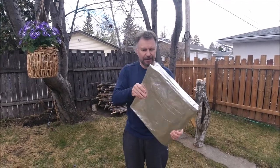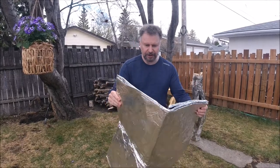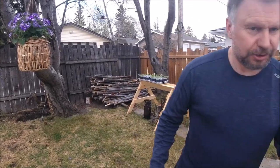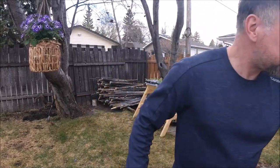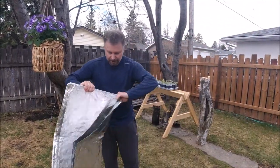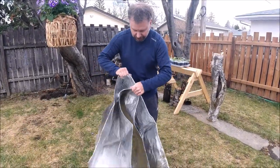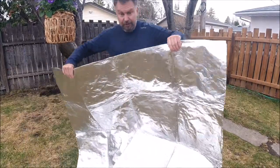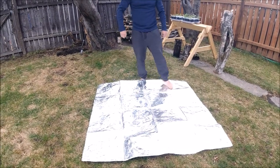So this is our solution. It's the same welding mat — fiberglass — but what we've done is we've taken aluminum tape, which looks like this. This is used for furnace ducts, and it's just like metal — it's like aluminum foil with a tape backing. Of course it won't burn because it's made out of metal. We've just neatly taped up our fiberglass mat that was shedding, and we really love this solution now. It doesn't shed at all, it's really durable, and of course it won't burn when embers get on it.